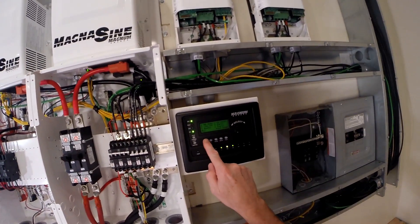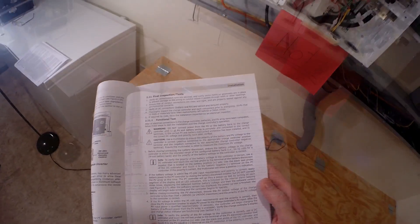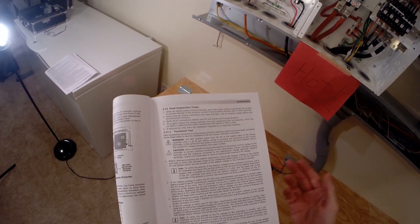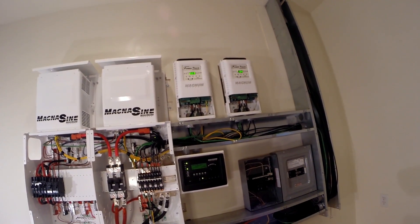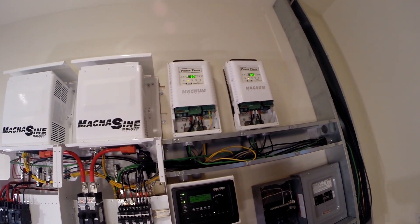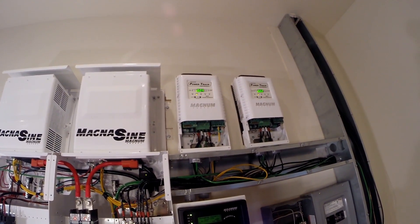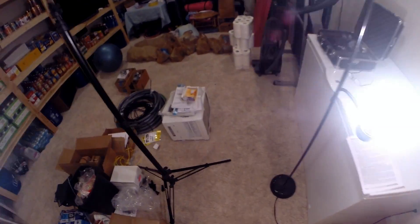Maybe I'll cut the AC before I do that so the chargers won't be rolling. All right, cut the AC — that cuts the charging. Now if I turn on the PV, we might get a little charging. Approximately 15 seconds — if there's enough power, the controller will begin charging the battery. There we go — now on our charge controllers — switched to absorb. 0.7 amps, 130 volts on the PV, battery at 52.7 volts. It's pretty dark on the roof — not much power.